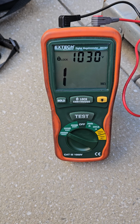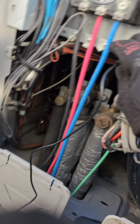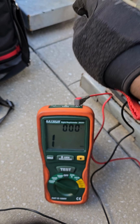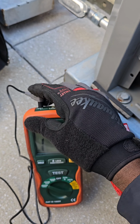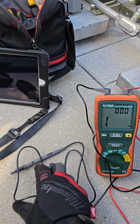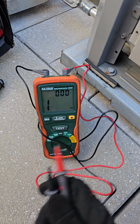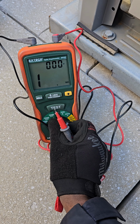Okay, I'm going to go ahead and do an ohm test, a resistance test across all windings. I'm going to test all my windings for continuity. And then I'm going to power this up. I'm going to reinstall the wires, power this system back up, and look for the amperage draw for a seized compressor. And then if everything passed and everything is good with that, I'm going to follow the additional troubleshooting guide that came along with this error code 26 on compressor number one, so 26-1.